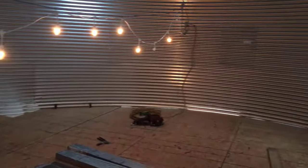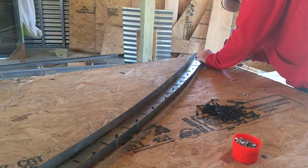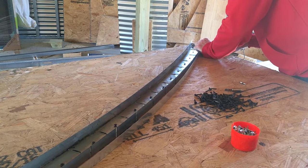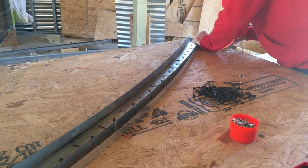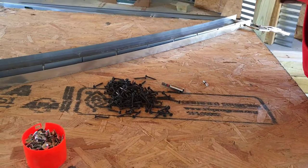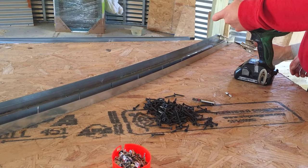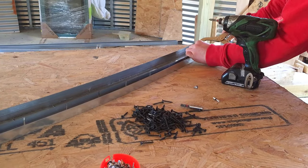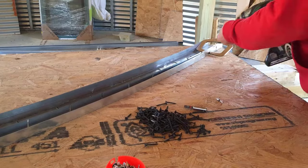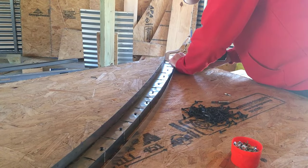We did get things accomplished on the grain bin during this time. You'll see video of the upper level where the framing went in — it's basically the same process as downstairs. There's a video where Carl talks about how to make a jig, because you have to make all the metal tracking at a certain radius to go around the grain bin. Downstairs he bought them, but upstairs we had to do more work making them flexible. The parts weren't available on the shelf this time, so he improvised — cutting each one with a grinder to make it flexible and turn it to the correct radius needed.